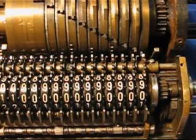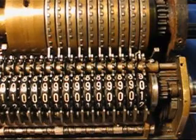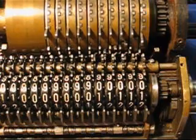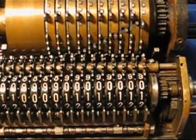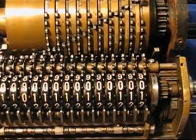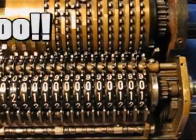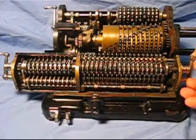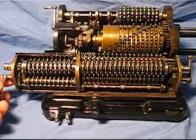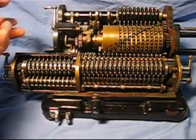The first tooth is going to bite. That raises the tooth. Now we've got the special tooth up. We're going to catch the first tooth. Next, advance, and next, and the last one. Woohoo! Now I just want to clear out the accumulator. We'll do a little pull back to zero, and we'll do the counter register back to zero, and finally we'll do the settings register. There we are, back to zero.